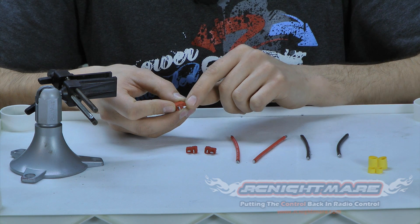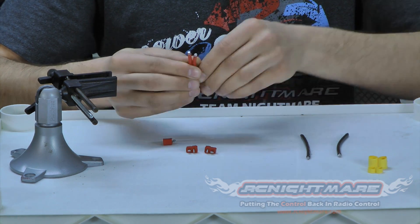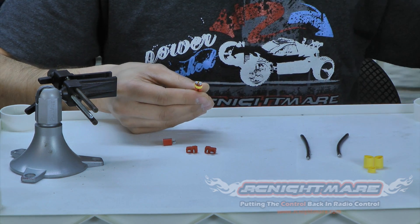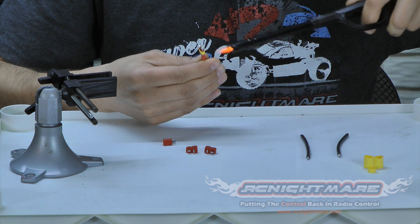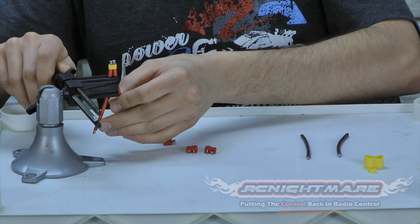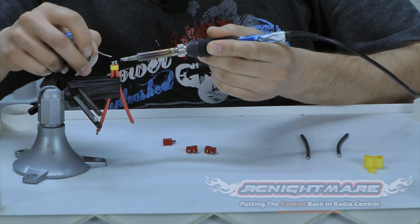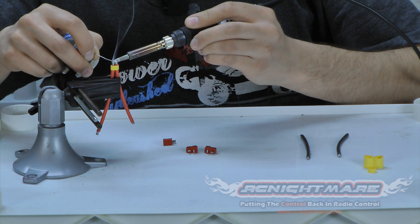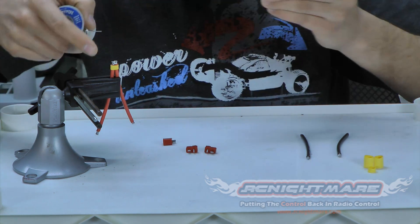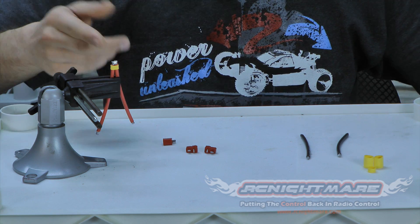We're going to have two red wires coming off the positive and two black wires coming off the negative. I've got my two red wires pre-tinned. I'm going to take a little piece of shrink tubing, just a small amount, slip it over the end right up close to them and shrink it right away. This is going to help hold the wires together. My whole goal here is to try to get the two ends of these wires tinned as if they were one. I'll take some solder and just soak the whole thing until I see that I've bridged the two wires with solder. The shrink tubing is going to help hold it that way for me.